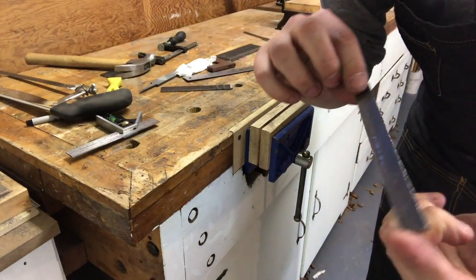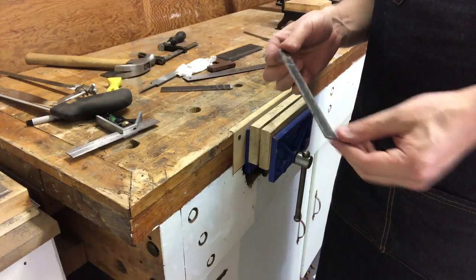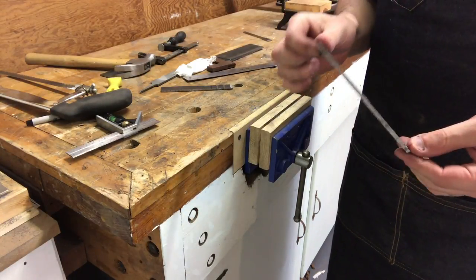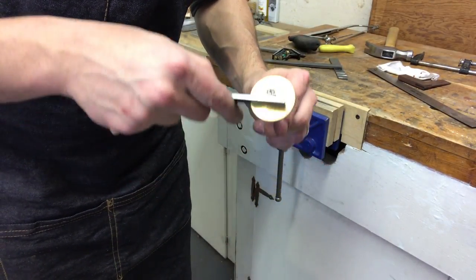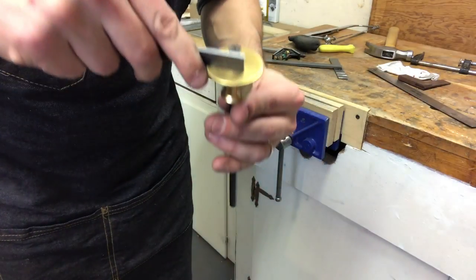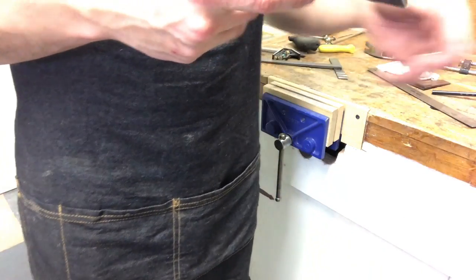All right, I'm very satisfied with the straightness of that cut. Believe it or not, my learning to saw better in wood has helped me a ton in learning to saw better through metal with a hacksaw. All right, I've got the second side cleaned up now. I've got it started to get cleaned up here. So I'm going to test to see if I have a uniform thickness here. I'm just going to use my marking gauge, which comes in really handy. That's really, really good. I'm just going to keep it as it is.